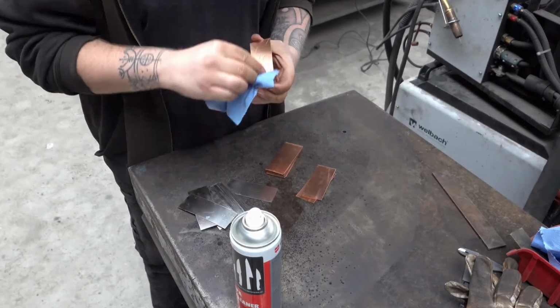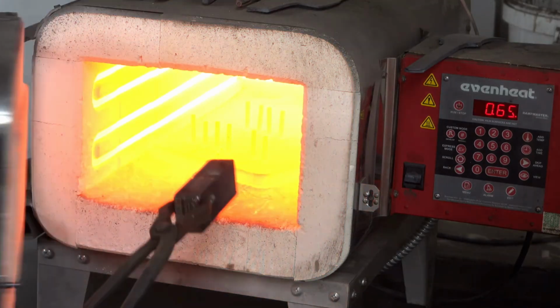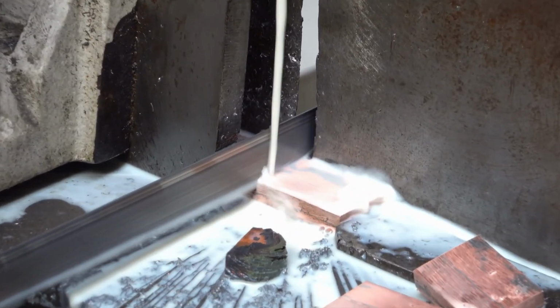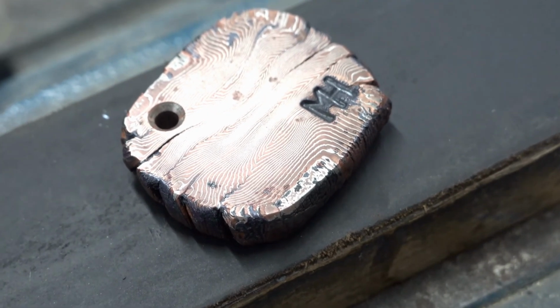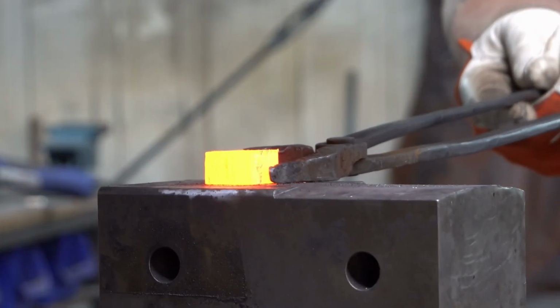Obviously, I had this good stuff going on with the forging of the copper Damascus in the heat treating oven. So I just thought, let's try it on this piece. Yeah. Let's do it. And I went full in. I did not just laminate copper and nickel together. I cut it up into pieces and made a kind of mosaic Damascus crush W pattern with it. Okay. And it worked out pretty fine. I had a few cracks, but in the end, the pieces for the bolster went perfectly.